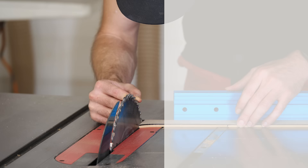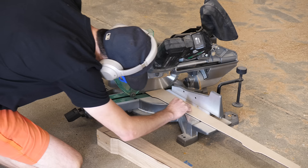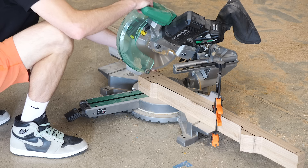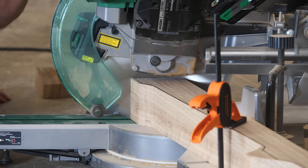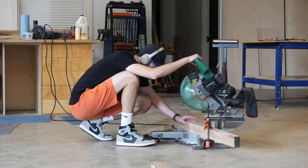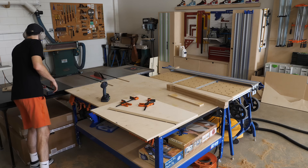The most obvious solution would be just lose the sled. You could use your miter gauge, referencing your template against the side of your blade and making your cut that way. You could also make most of these cuts on a miter saw — in fact, I cut the tops of my legs this way. But since my setup isn't super accurate, I left them about a sixteenth of an inch longer than needed and will clean them up later. This is okay because it's a much less crucial cut — it's just where the piece ends. That said, while you could cut these joint faces on a miter saw, you couldn't cut these others. But I wanted to stick with my sled technique.